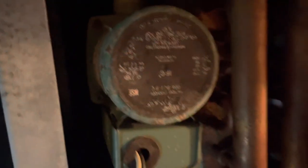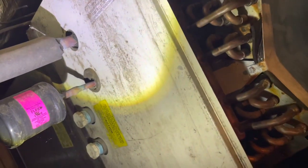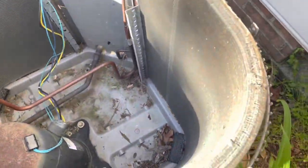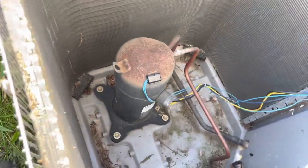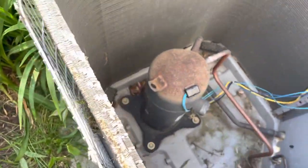All right, let's get this cover opened up. Here's our air handler. This one has an internal circulator, which is nice. Here's our coil — I have to get this cover opened up a little bit. I can't take it all the way off because the refrigeration lines go through it and the drain lines as well, so I'm going to try to leak-check it the best I can from right here. I also popped the top on the condensing unit and went around with the leak detector.